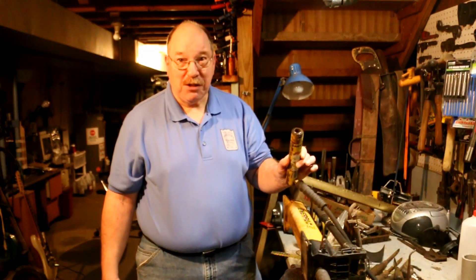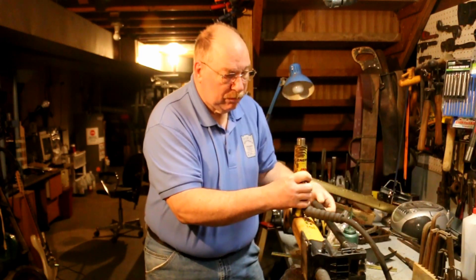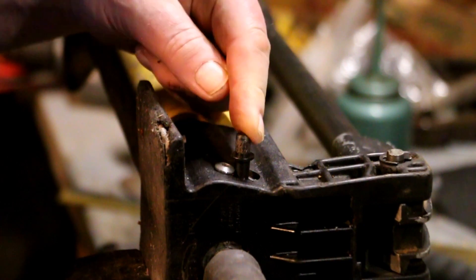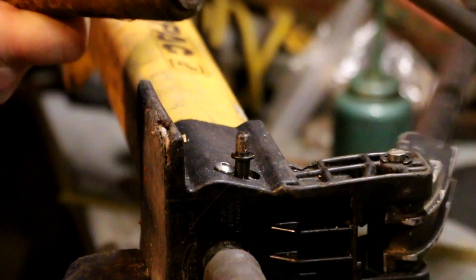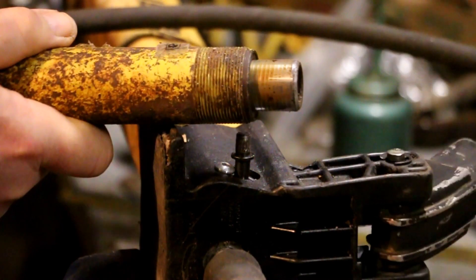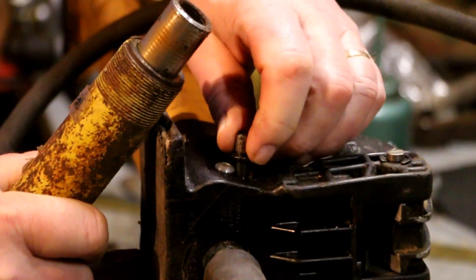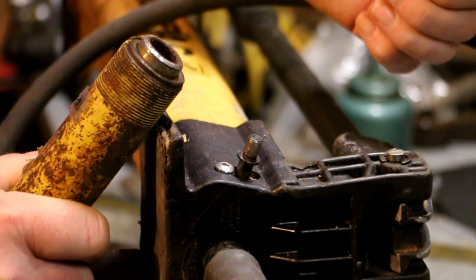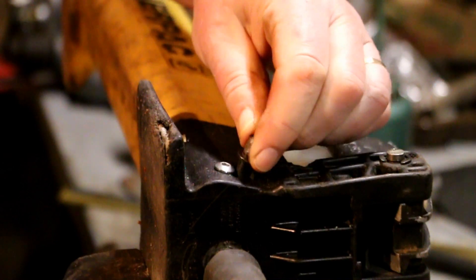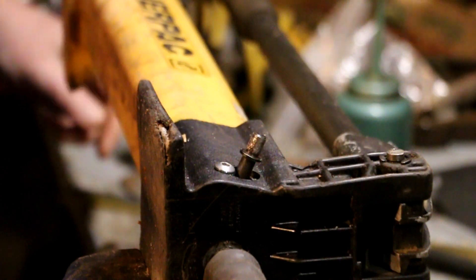This particular one came with a mounted cylinder and a hydraulic pump, but there's one problem — actually there's multiple problems with the pump, but this is the one we're going to attack today. You're supposed to be able to just open this little valve and let the cylinder retract. The problem is, sometime in the past, this little valve got bent and that valve handle got broken off of it. So I need to make a new handle.